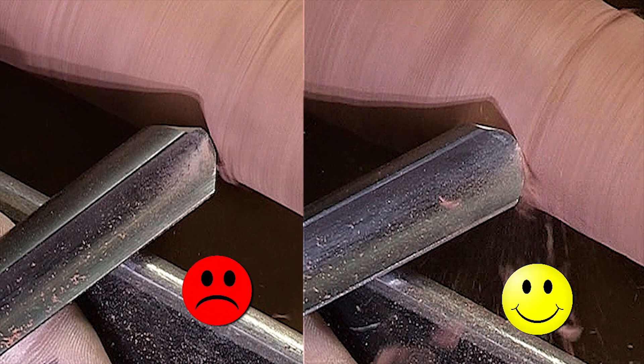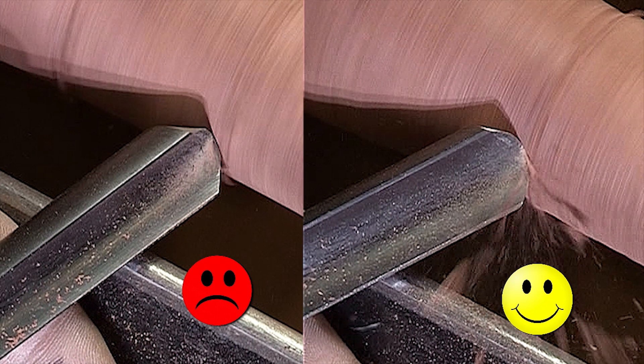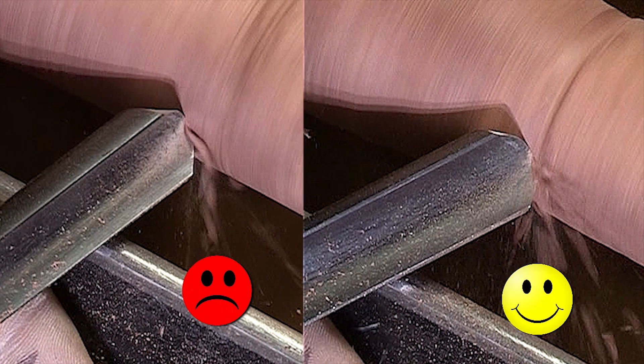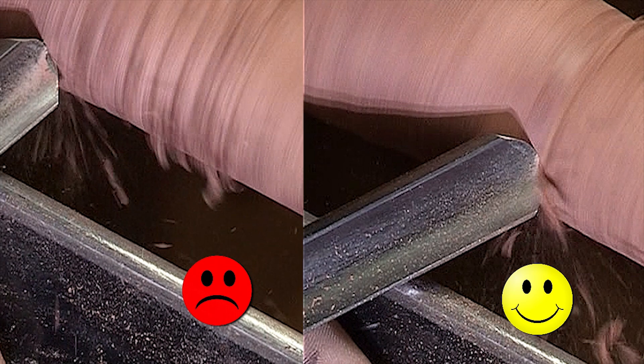Look at the small differences here — they're really subtle. The tool on the right is aiming more to the right, pointing the way it wants to go, so the bevel's rubbing. On the left, it's pointing straight in — no bevel rubbing. Also, the tool on the left is rolled over more, so it's more of a knife edge. The tool on the right is rolled open, so it's more of a slicing cut.